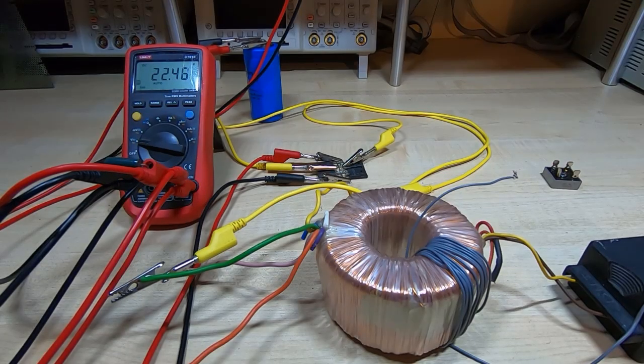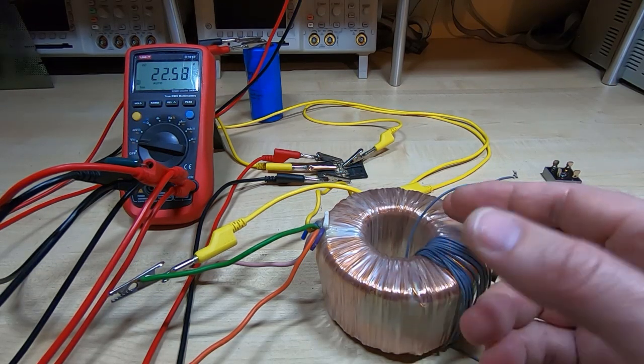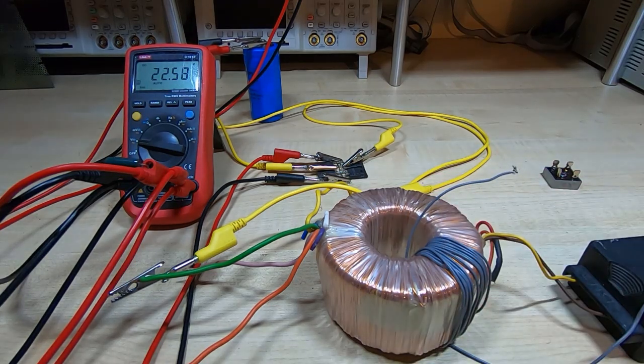This is a very efficient circuit — useful if you're running into problems with an existing piece of equipment not having quite enough output on a DC rail, or if you have too much DC output, in which case adding a few turns to the primary winding is a good solution, as long as you do it safely and insulate it properly. In the next video we'll be looking at rewinding the transformer dismantled in the previous video. I'll also be demonstrating the CNC winding machine fairly soon, as I've had a few requests for that. Comments are always welcome.